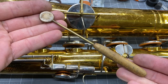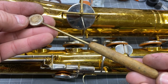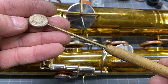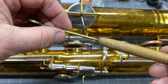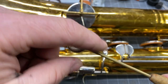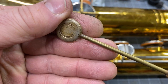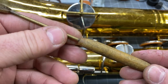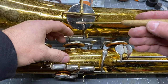First tool up is a tool that you can buy — I made this one. Dig through your parts; this makes a good project, especially on snow days or when the shop is slow, just to learn a different skill set. This is a piece of dowel, this is a piece of brass rod, this is a flute key. You cut the flute key off, silver solder it — so you work on your brazing techniques — put the dowel in the lathe, make the shape that you want, drill it, put some glue in it. It's great. What is it? It's a pearl protector. Now you can add fire and you're not going to melt the pearl or the plastic.